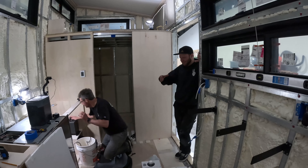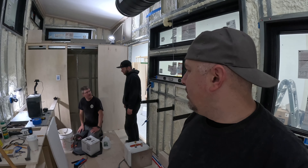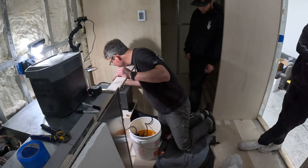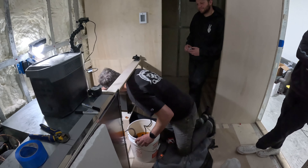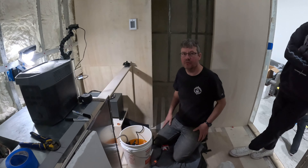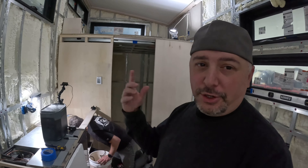I've been telling them they need to get into the tiny house market. This is my heating system — Van Life Tech has been in around 300 vans on the road now. Through several polar vortexes over the last few years, the system has held up. The glycol mix ratio provides freeze-burst protection down to negative 50 degrees. That means if it was just sitting out in the woods winterized, it could get to negative 50 and it wouldn't burst.